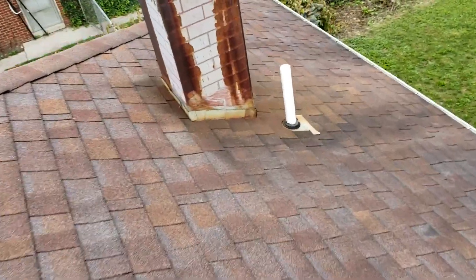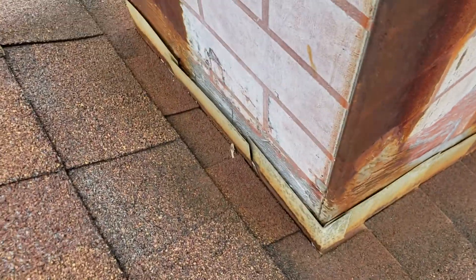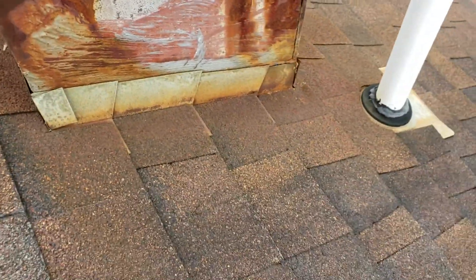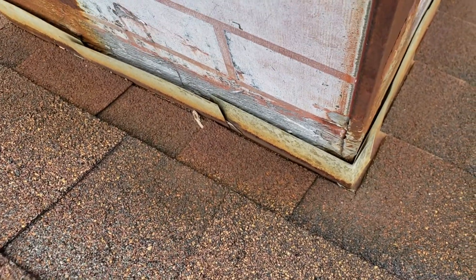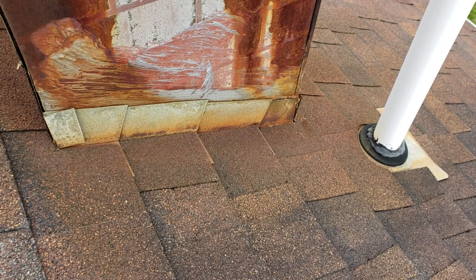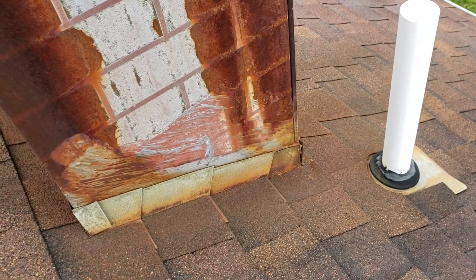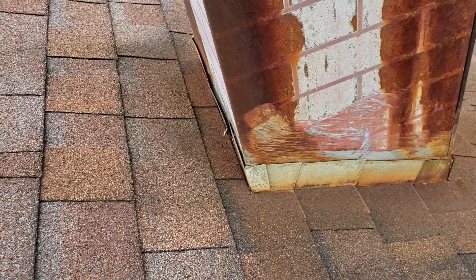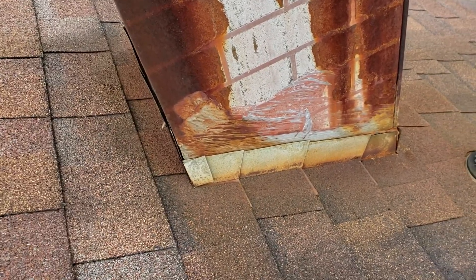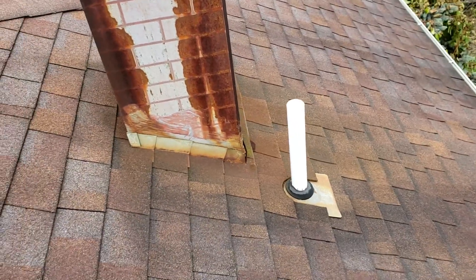This chimney over here — we always have problems with these chimneys. Right here, you have step flashing with absolutely nothing covering it. As you can imagine, rain hits this chimney and it's going to get into your house. There's no way around it. If you're not seeing water on your ceiling at some point, you're very lucky because this is kind of a disaster waiting to happen. We would put a saddle behind this, kick out all the water around it, flash it, and then counter flash it. We have a system. I run into these metal chimneys a lot, so I do know how to take care of that.